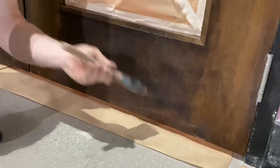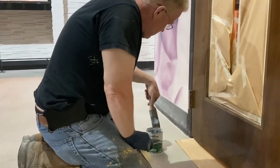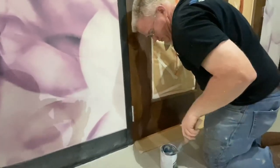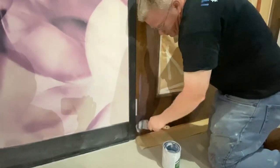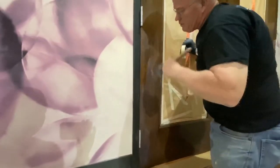If you look at the door in the bottom right corner, you're seeing the grain going up and down. You can see it's a different part of wood than the adjoining piece to its left. If you were to stop and try to divide those two parts when staining, you would inevitably bleed onto the next part. When you stain, you really have to be ready to stain the entirety of whatever you're staining. It's not like painting — you must do it all at once.